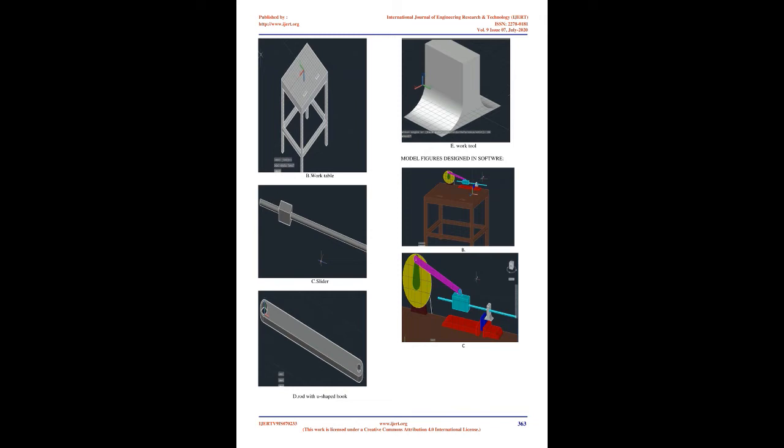As the tool moves forward, the tool cuts the material with the front cutting edge and moves forward slightly. At this time the worker has to pass a feed to the tool as the ram returns in the return stroke. The tool having another cutting edge opposite to the first cuts the material as the process goes on. The speed of the ram is regulated by the gears or by RPM.